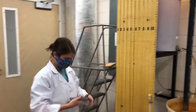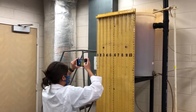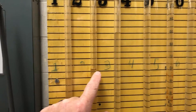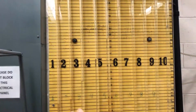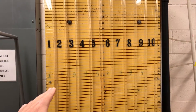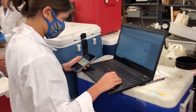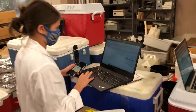Show us how you measure the piezometer reading. You're just taking a picture of where the piezometers are located — these water levels. She's recording where the water levels are for each of the piezometers. Notice that it starts low and goes high because this one is connected to the bottom of the filter column, and these are connected to the top — so the head loss goes from top to bottom. She's entering them into her computer and we've got a nice graph started showing the head loss.